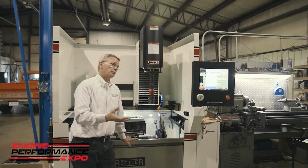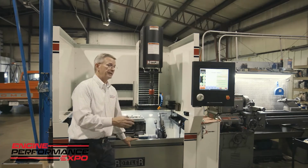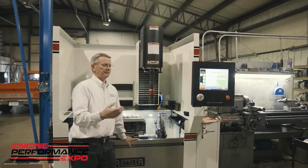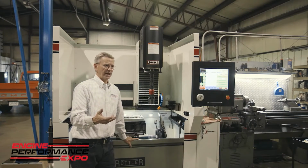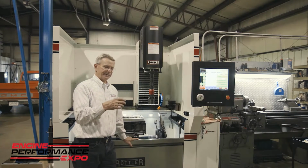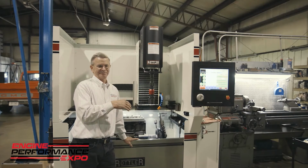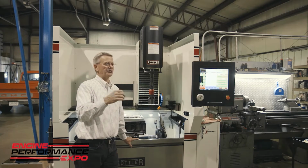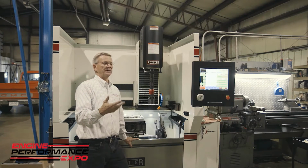So we've roughed it with the diamonds, and we should have some really deep RVKs, and we'll check that in just a second with our profilometer. One of the other things I did want to talk about, though, is I get customers that constantly ask me, well, if I vary the pressure, can I get more RVK? And my first answer, and my answer with no explanation, is no. It's not going to matter.